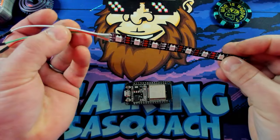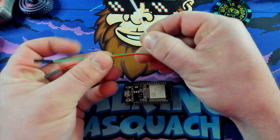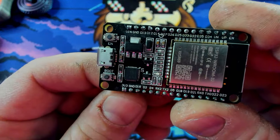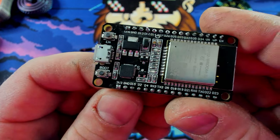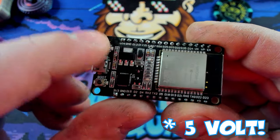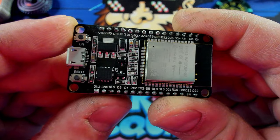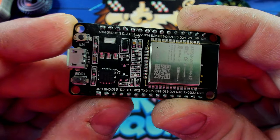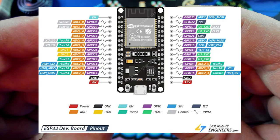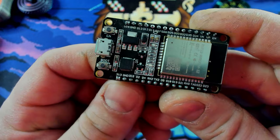Our NeoPixel lights come with three wires: a white wire which is ground, a green wire which is signal, and a red wire which is power. On this ESP32, there's nothing named 5 volts — it's actually called VIN, voltage in. So that's the one we're going to use for 5 volts, and then we're going to use the ground right next to it. Then we need to hook up to GPIO16, which is the default for WLED — if we look at our ESP32 pinout diagram, it lines up with RX2. So let's plug in some wires and get started.